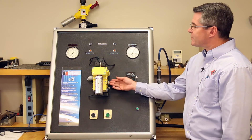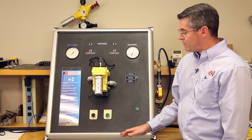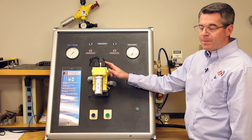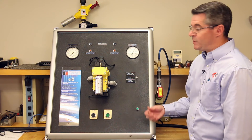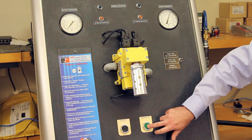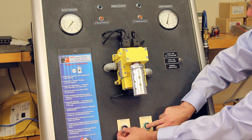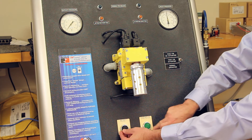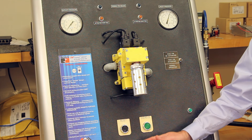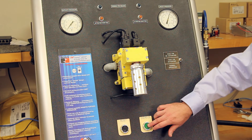It's critical to have that supply pressure, have no solenoid signals on the main solenoids, and to give a momentary reset, followed by a momentary delay before you would re-energize the main coils. If we don't have a delay, you will also continue to be in a faulted condition. So I'm going to create a fault and then try to reset the valve and re-energize it too quickly. You have to have that slight delay after the reset — again, about 250 milliseconds from removing that signal before giving the main energization signal.